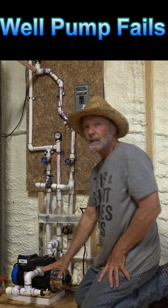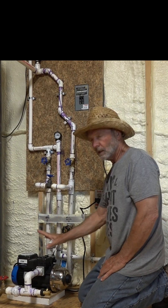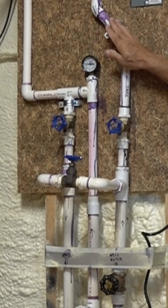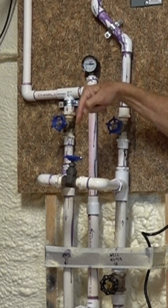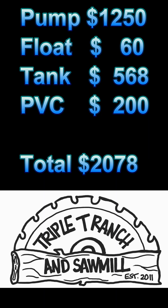In the event that we have problems, if their tank is full — let's say it's 250 gallons — they could run for 250 gallons before needing more water. They could call a potable water company to deliver water and fill this tank up. Or if this pump fails, they close this valve and this valve — this one being the tank fill and this one the supply back to the house — and open this bypass. And they're back to where we were before we installed the pump. They ran since last July on a bypass, so that's how it works.